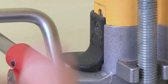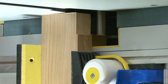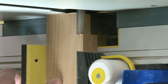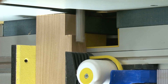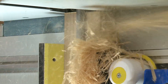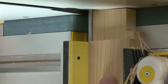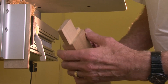Cartwheel the rail to do the other end — you can leave the height at haunch height. A trim cut and a rail end at haunch height. Then find the haunch position on the measuring rod and cut the full haunch. Drop the bit to full depth and cut the front of the tenon going clockwise. One rail with haunch tenons.